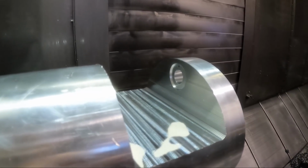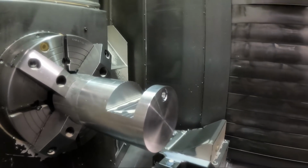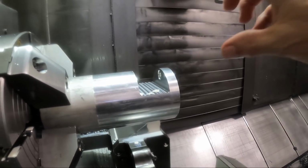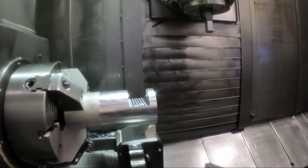So I'll just go with a centerline tool path, and I'll just have to adjust it either with a stock allowance or change the diameter of the end mill slightly or something. They came out about 4 thousandths under the nominal, which is still in tolerance actually, but they're a little bit small, and I can adjust it.